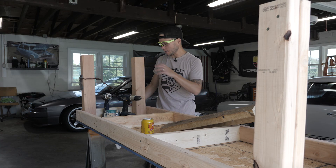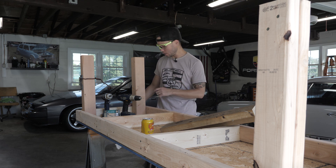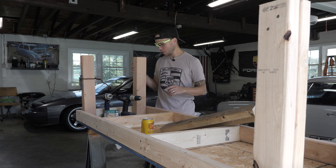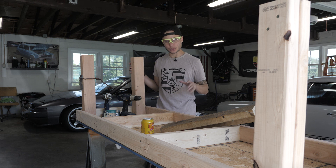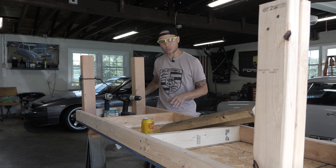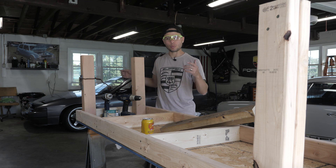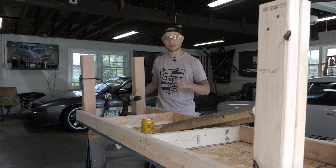What I'm going to try here is put one screw into each leg to get it somewhat secure, and then place the other frame level on top and try to even things out that way. Rather than getting into a situation where if I put all the screws in and something's off — I don't want that top level to not fit.